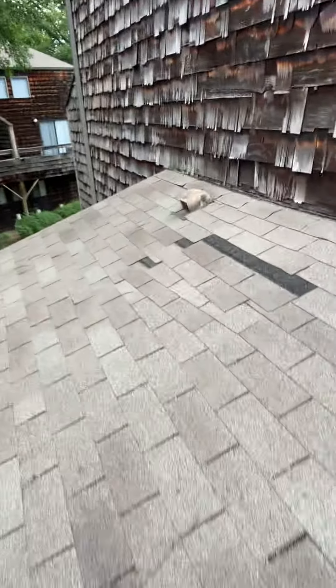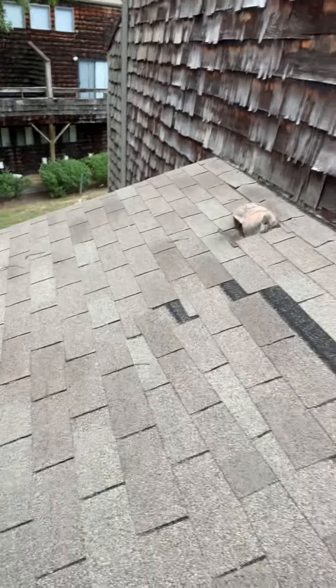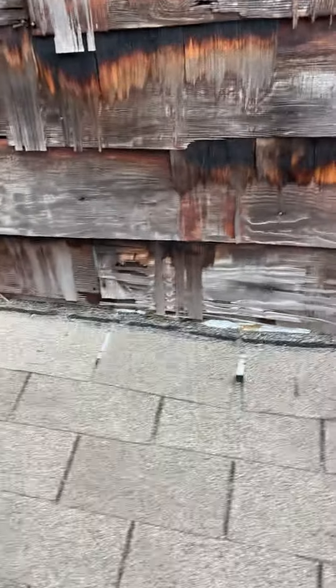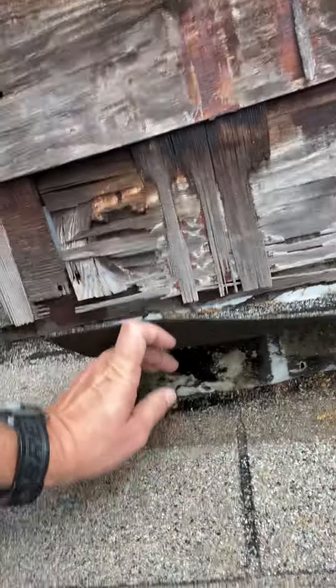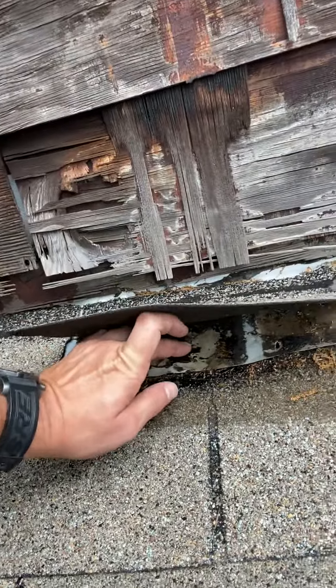This is one that's going to have some pretty immediate needs. It's got some sliding shingles. This is on a section — these roofs are sectioned off — and I'm going to shoot a couple of videos, one for each section. We've got some flashing that you can see, sort of pushing up on these shingles. And what I'm really worried about here is the water coming over and getting in nails like this and leaking.